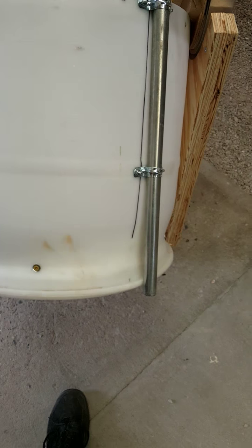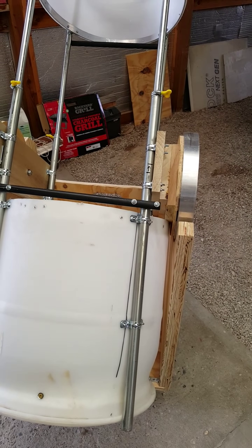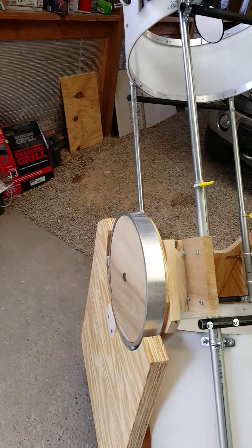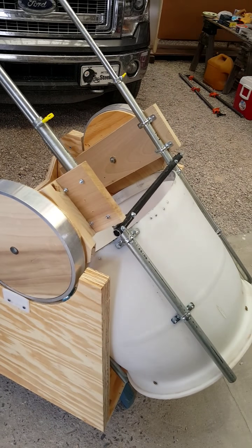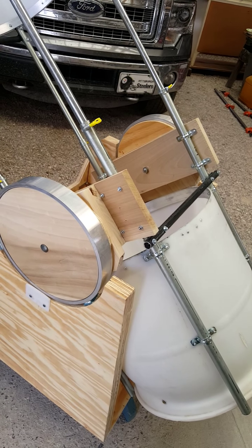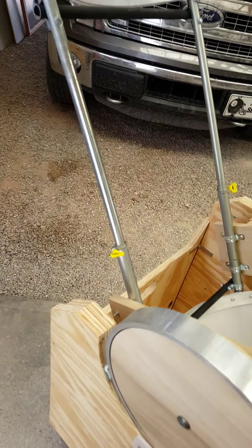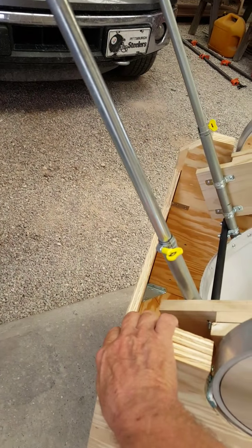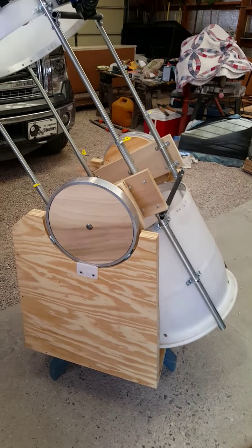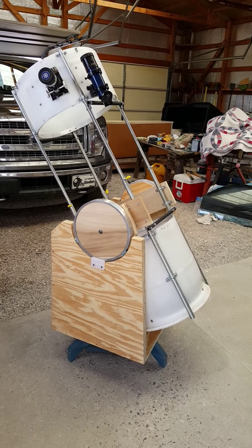The tube is 19 inches in diameter, the optics are 13 inches, F4.5, and the focal length is about 59 inches. The whole OTA turned out to be about 60 pounds because of the declination axis, which pushed the weight up considerably. It still needs to be painted and it's going to need a light baffle, but there you are — a 13-inch Dobsonian made out of a 30-gallon barrel.